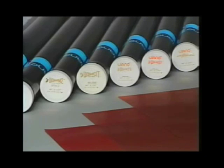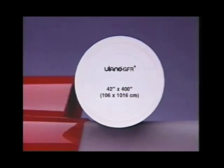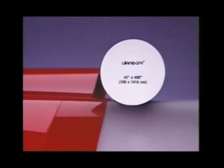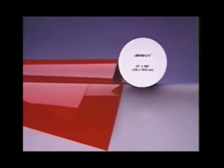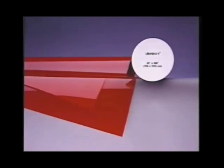Depending on your application, you may select from many types of Ulano pre-sensitized photographic films. The processing of all of them is similar, although slight differences in processing temperatures and exposure are needed to optimize the results for each product. For the purpose of this particular demonstration, we will be using Ulano GFR. GFR has exceptionally wide exposure, development, and washout latitude. This film is useful on a broad range of mesh counts, and thus is suited for a wide range of printing applications.